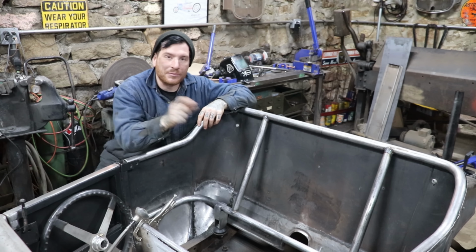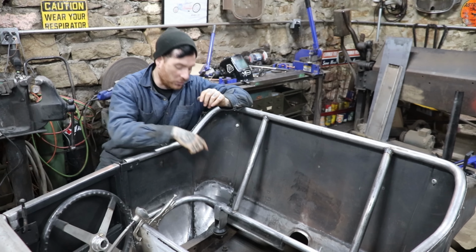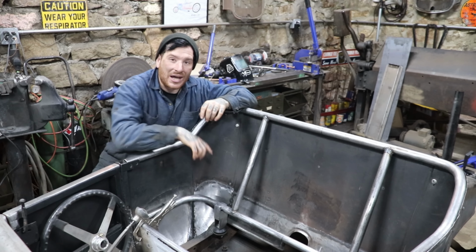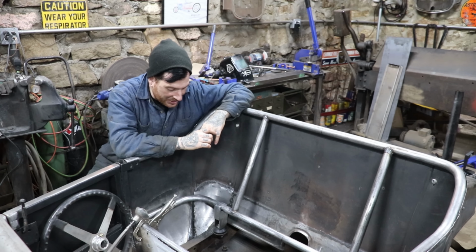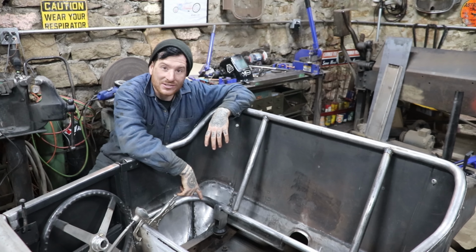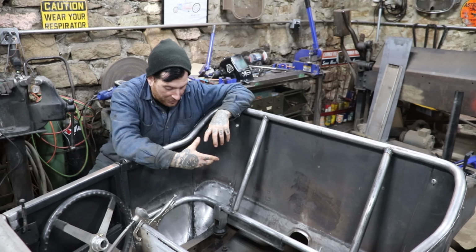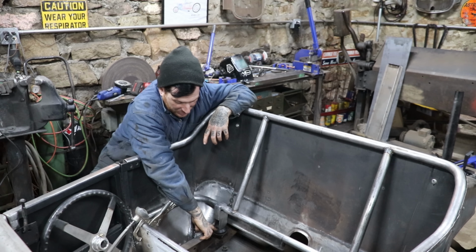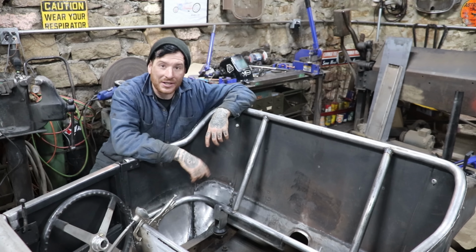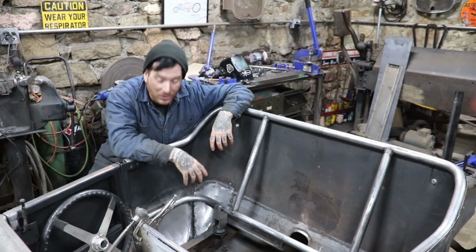I welded across the top. There was a little bit of a gap at the top where everything came together that I filled in, so that keeps it in. I have it tacked around the sides like you guys saw me dropping tacks in, and of course it's bolted down. I used flathead V8 style biscuit motor mounts for the rear here. It worked perfect, ran the bolt up through. I have a nut, and there's a little window here that you guys saw that's open, so you can get a socket in there and hold that and tighten it up, and should work pretty well.